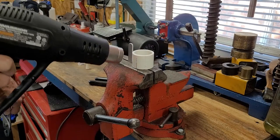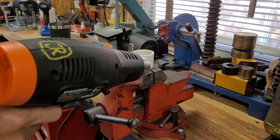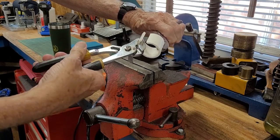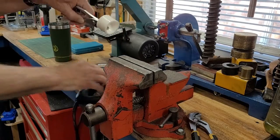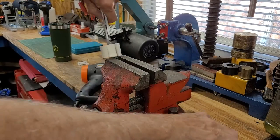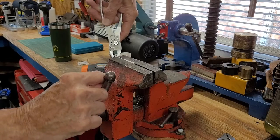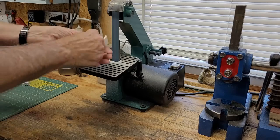Now using a heat gun or a hair dryer, you'll just heat up one side of it for about an inch or an inch and a half along one end of it. That'll be hot enough to get it pliable. I'm using a couple of pairs of pliers here — you can also use some gloves, but be real careful, this is hot. All you're going to do is get it in a relatively straight piece, and once you get that you can put it between two pieces of board and clamp it together. Or in this case here, I'm just using a vise to clamp it out and wait until it gets cold.